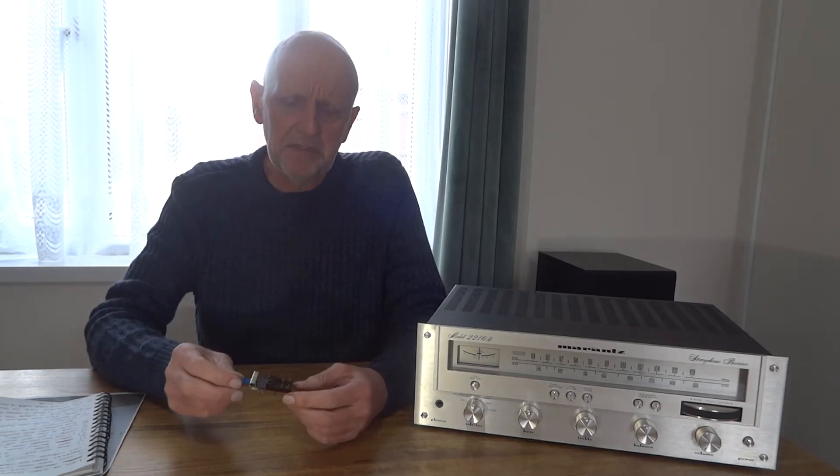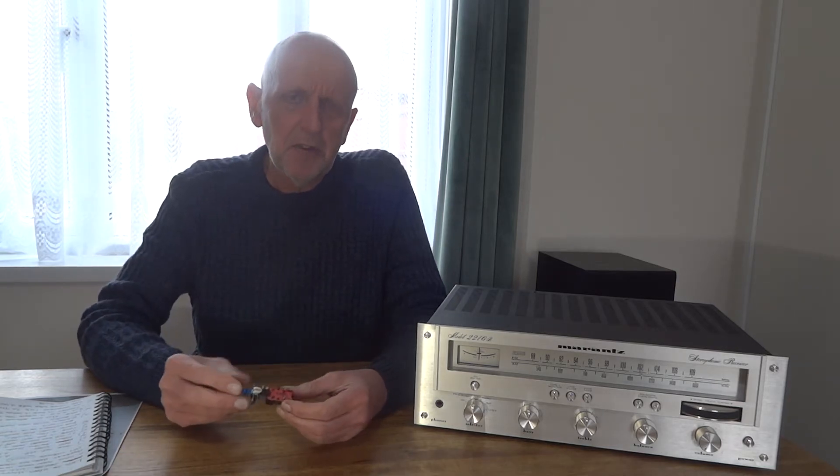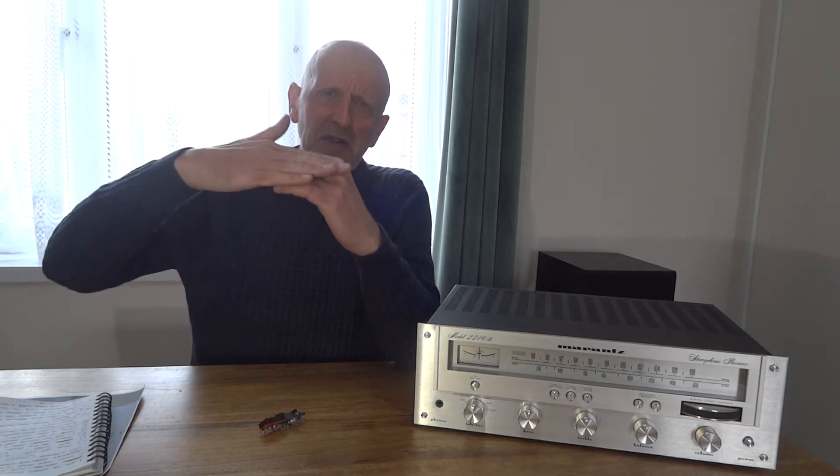These switches in these receivers are nearly 50 years old — on and off, on and off all that time. The wear and tear on the contacts means that where one plate slides on top of another, they're kind of spring-loaded. Over time that wears out, and where the two plates touch there's not a proper firm contact — it's a loose contact. When that happens it can arc; electricity kind of bounces between the two plates, very fast.